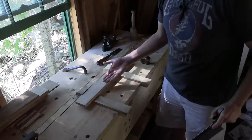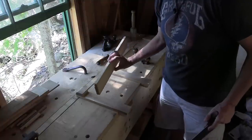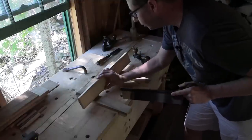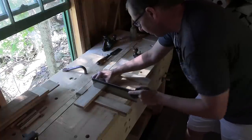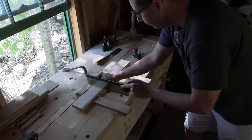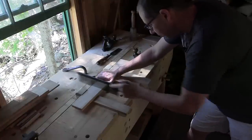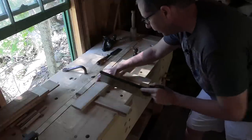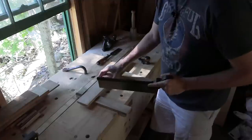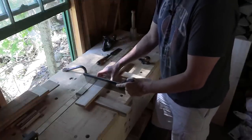But one of the other things in cutting a dado is you've got a certain depth line you want to see to. And sometimes it's just hard to see. So you can quickly pick it up, check both sides of the cut. Check that far side until you get right to your line and you're good to go. And the fact that I haven't restrained the board or clamped it in place or anything like that means that I can very quickly cut right to my lines. And again, if I misaligned at all, the board is going to want to walk from side to side, it's going to want to jump, the saw's going to bind in the cut, which is going to cause the board to jump,